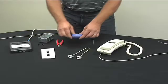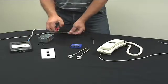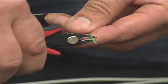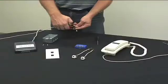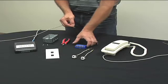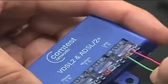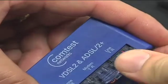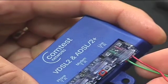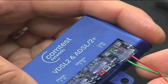Now for the wiring of the unit. If the wire has been previously used, cut off approximately half an inch from the end. Do not remove the insulation from the wire and maintain the wire twist. Observing the proper orientation of the tip ring leads, fully insert the incoming pair into the line IDC. Firmly press the IDC closed until it locks into place. This will complete the connection. It may take some force to close the IDC with thicker wire gauges.